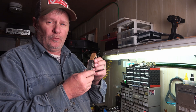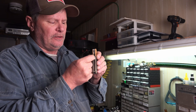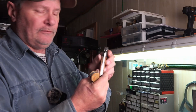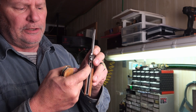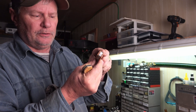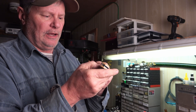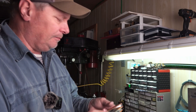I still have a good bit of work to do. I still have to contour it, and I have to come in here and relieve the panel material where the liner can move over — like I showed in the beginning of this video. I've got to cut in here to let the liner move and give it some room. This one's contoured, and I'll contour this one after I do that relief work, do the cleanup, and start fitting the blade to it. But right now our billet's cooled off. Let's get it cleaned up, test etch it, and see what we've got to work with.